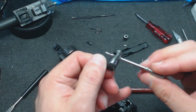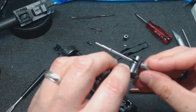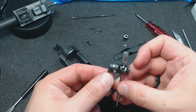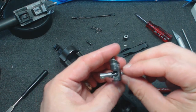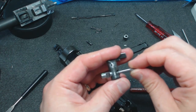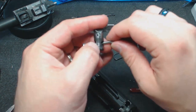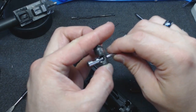In the fire position, it can actually come inside the body of the safety just that much. But in the safe position — rotating here — it actually locks that firing pin up. That firing pin can't go anywhere. When it rotates over here to fire, the firing pin can come past. The firing pin has to come into the body of the safety just a little bit, and it can't do that when it's on safe.